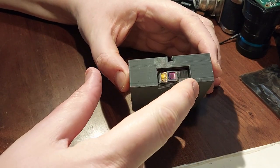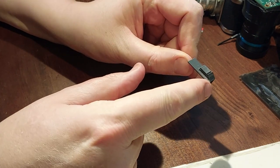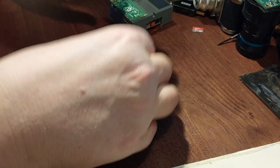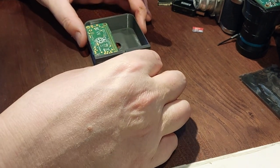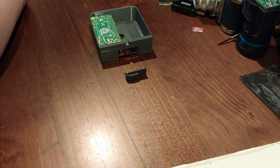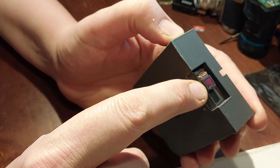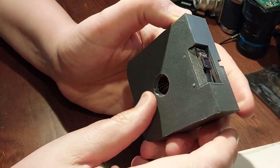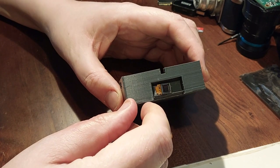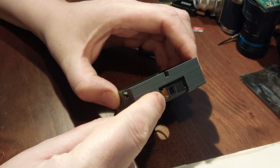What I did was create a cartridge with a big opening in the front and a little carrier for the camera. There's a slot that you can put the flexible PCB through, it screws into the cartridge and I can adjust its position. The trouble is the thickness of the glass UV filter on top of the sensor is enough to push the sensor back by about half a millimetre. I can't get it exactly where the film goes, which changes the focus properties of the lens, which means I've created a great macro movie camera but a useless filming-scenes movie camera. My next step is to try and deal with that.